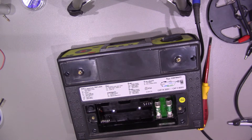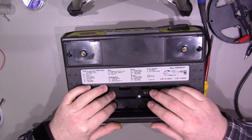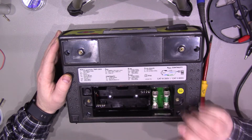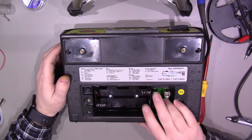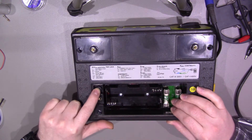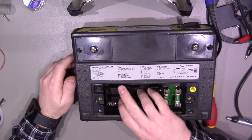This is your battery cover. You can see our battery pack there. It's nicely designed in that you could potentially change the battery to, say, four double-A's or a rechargeable pack, so long as you're getting six volts — you can just unscrew it and put in what you want. There are two big fuses — I would expect those to be HRC fuses. Fuse one is 4 amps and the other one is also 4 amps, and they are time-delayed fuses. Then there's a third fuse underneath this cover rated at 315 milliamps.